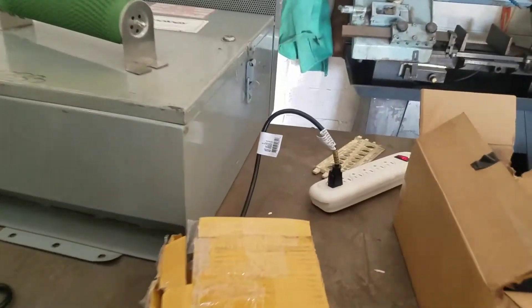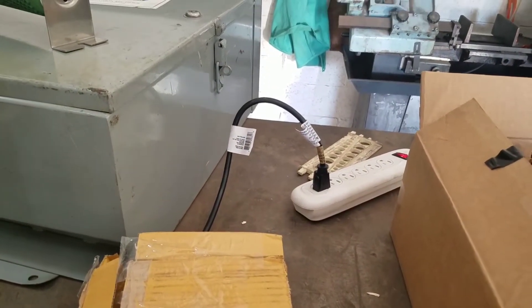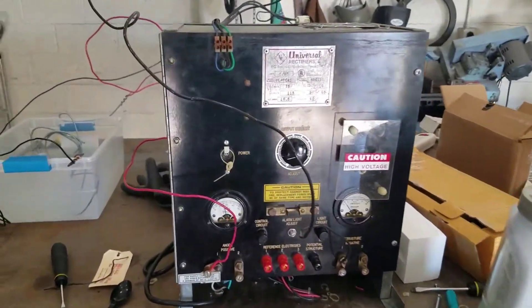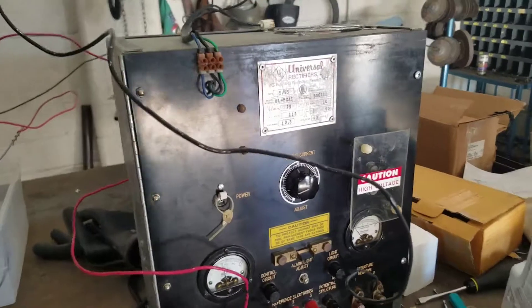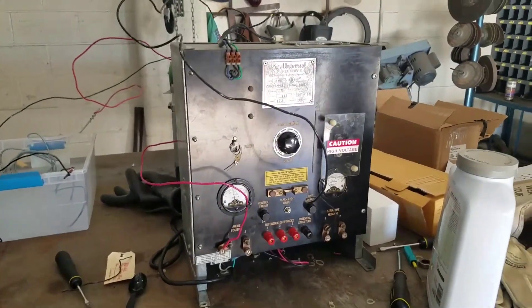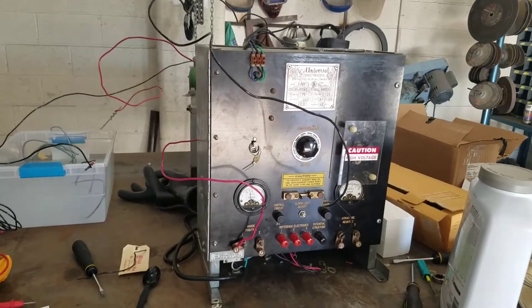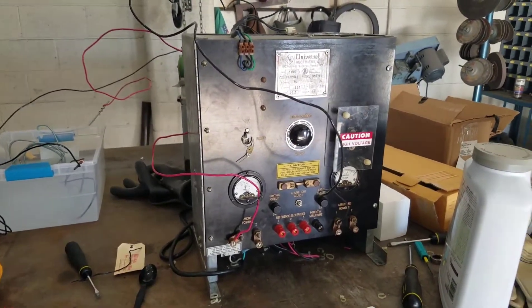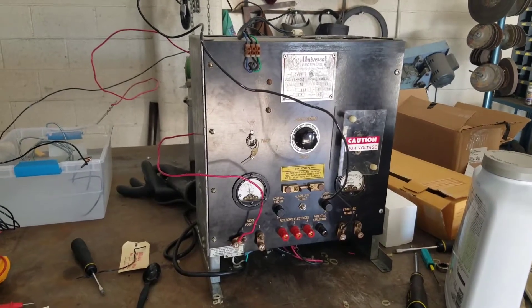It's being fed by this right here — 120 volts AC at 60 Hz, standard household power — going into our rectifier. The rectifier has inside of it what's called a diode bridge, or rectifier bridge, rectifier stack as they refer to it a lot. Basically it's made up of four diodes, and those four diodes are what do the work of converting your AC power into your DC.